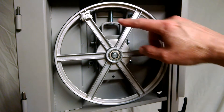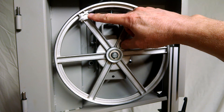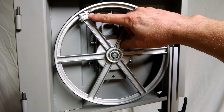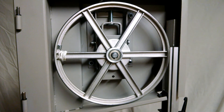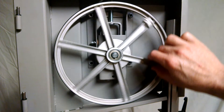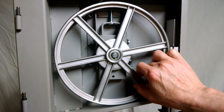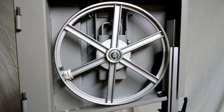What I did was attach about a 10 inch piece of twist tie here that had a double wire in it to see if that might provide the right amount of weight on that side. So let's put the wheel in several different positions here and see if that wheel moves. And as you can see, as I put the wheel in several different positions, it stays put. And that means that that wheel should be pretty well balanced.